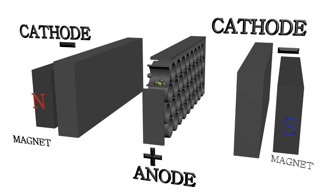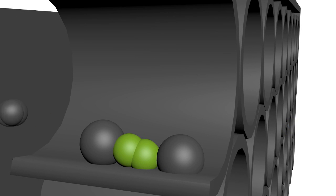The positive gas ions move again towards the cathode to kick out even more electrons and titanium atoms. The titanium atoms that are kicked out may also deposit on the anode and in this process bury some gas molecules under them.